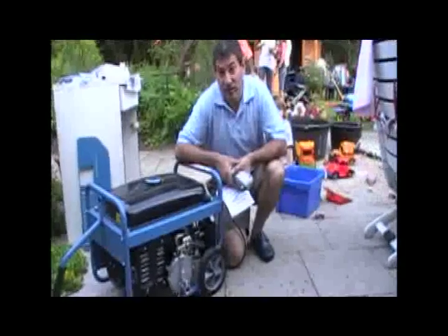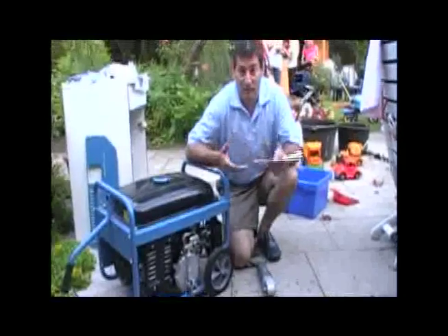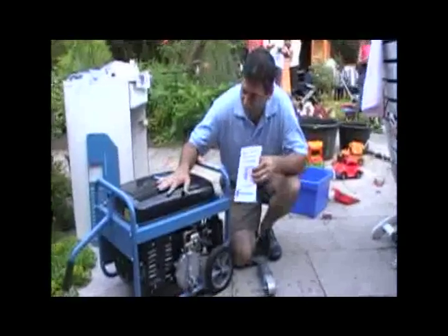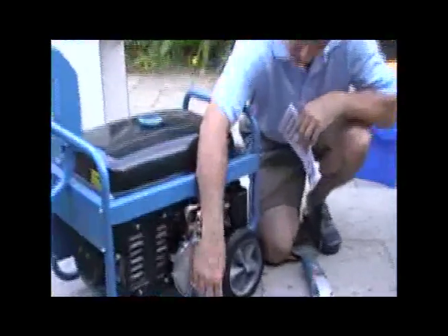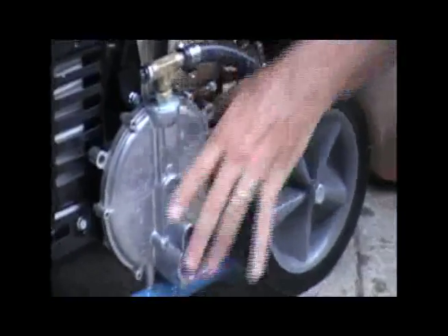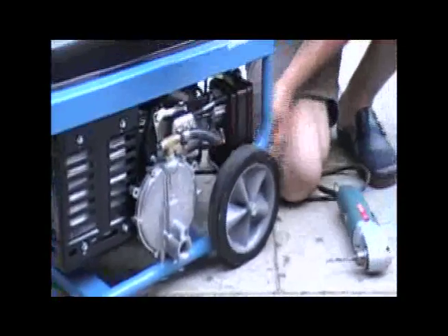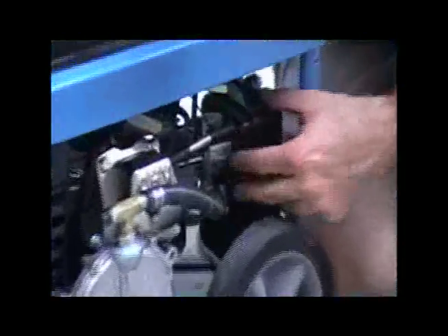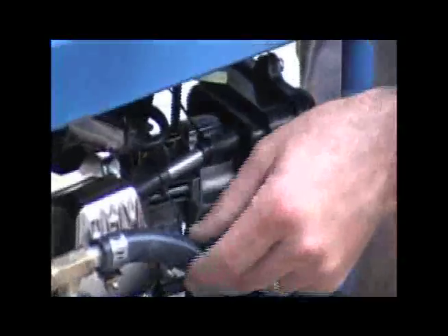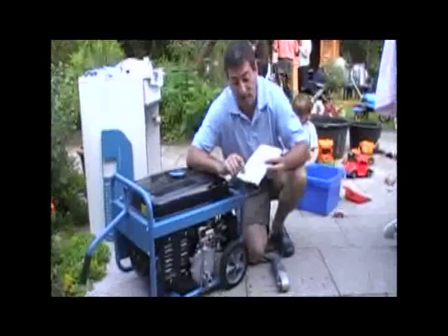Here we have it — June 27, 2010, Kilian's second birthday, for a better future for our son. I celebrate this day not only with a great party with great friends and family, but also by making the simple conversion of a backup electricity generator to run on biogas that we make from kitchen garbage. This is the regulator right here, and the biogas will go in here. There is a button on the other side that one can press to let the gas flow in. Then we start it up. The other part of the conversion was this bushing right here — just two simple additions to the existing engine. This bushing adapter goes onto the carburetor and onto the air filter, this hose goes to the regulator, and the regulator then takes in the biogas. So we're ready for biogas operation thanks to this kit from U.S. Carboration in West Virginia.